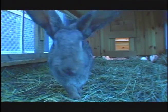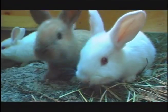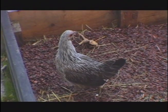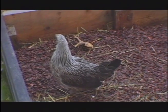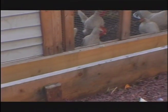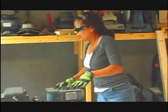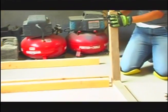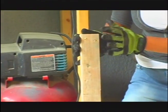Remember, you don't want to use pressure treated wood when dealing with animals or housing animals on your raised beds — they're going to interact with the soil. Animals also have a tendency to chew on wood and you don't want that ingested by any animals. So we've got just regular pine lumber here, and I've laid everything out already and pre-drilled the holes in the wood.